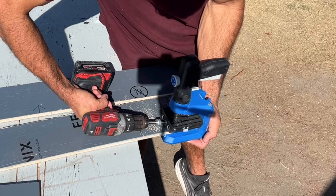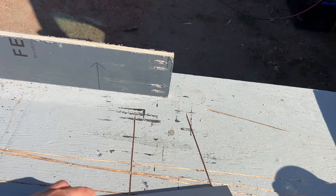I haven't made a drawer box in a while, so I did make a little mistake here. On the back side, I put the pocket holes on the sides instead of on the back, which is perfect because no one would have ever seen it. So what I'll do is I'll take a piece of quarter-inch, laminate it, and then glue it over those pocket holes.